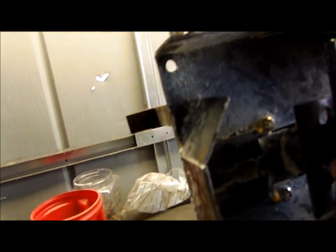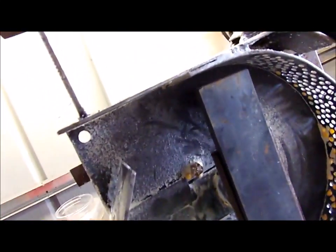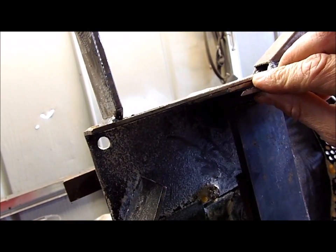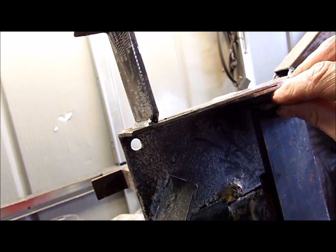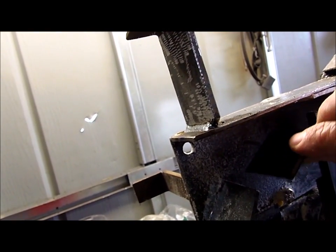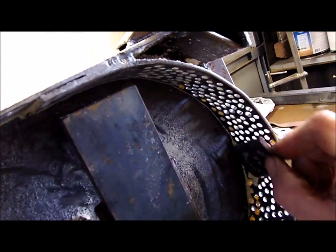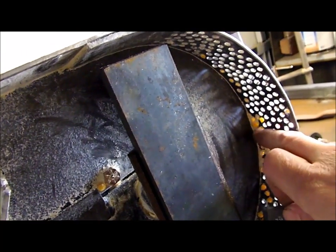Here's what I'm going to do. If we just put the bar in there, we're going to have to drill some holes and get it centered and make sure it's kind of balanced. But imagine that is centered right now. It's pretty close. I've already cut one of these blades in half. And what I was thinking I would do is actually mount the blade like this. It'll end up being a little closer than that. I don't know which way around I'd put it. I think I might put the cutting edge more like that. So this is essentially just one blade. And as it's going this way anyway, I might even put a hardened edge along here. The idea would be it'd catch these bits of corn here that are right at the end and just smash them and drag them round, and hopefully it'd be pretty close to this, within an eighth of an inch all the way around, and hopefully drive out anything that does get wedged as well.